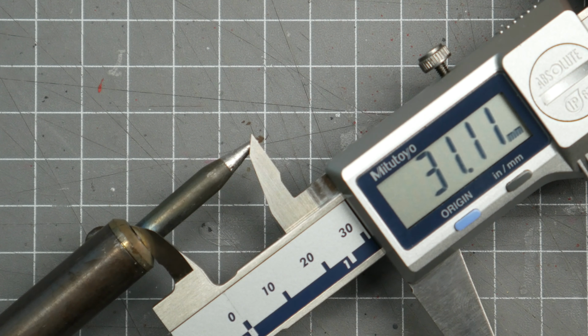These irons do have replaceable tips as well, but it can be hard to find them or they need to be special ordered. Best to check availability before buying. The downsides to this type of iron: the cable is usually standard 3-core double insulated, with the insulation being PVC, which is quite stiff and likes to hold its original coiled up shape, so it can be difficult to handle. Another thing is the tip to grip length is pretty long, which also makes it difficult to work with. If you want a cheap iron to get started with, this type works very well. They should be readily available at almost any home improvement store.